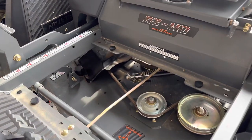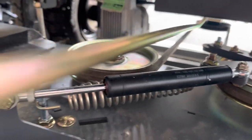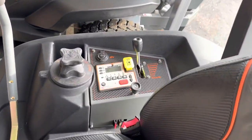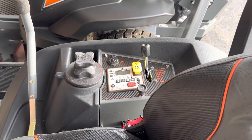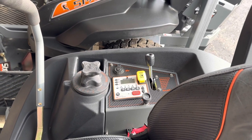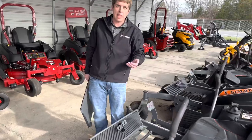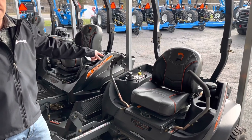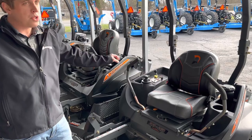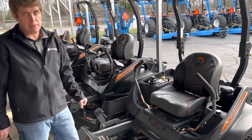The dampener is something pretty unique because it's typically just a spring on most mowers. We're the only manufacturer that uses it. Going back to this console, it has what's called a smart start clutch. This PTO switch pulsates when you turn it on — for a little less than one second — so rather than a hard engage or hard off, it allows it to slowly come up. That helps the life of the clutch and everything else. They rate that PTO switch at 250,000 cycles, and for that reason, the manufacturer gives a lifetime warranty on the PTO switch itself. The console is three years, but the PTO switch has a lifetime warranty.